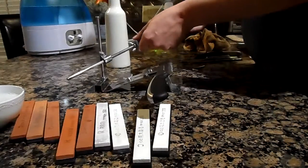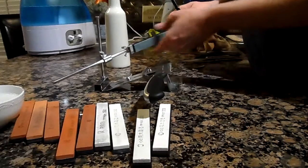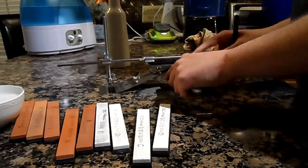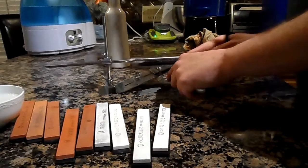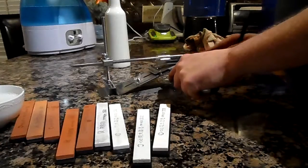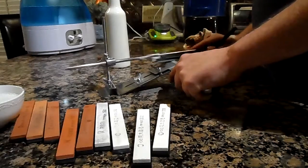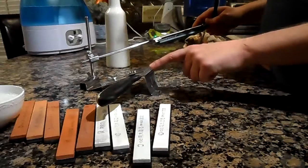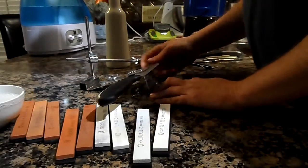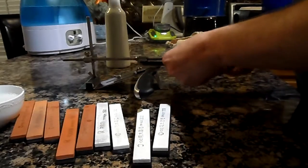The dogs are a cool thing — it's just that quick. After you get used to using this thing, it's almost an afterthought to get sharpening with it. This handle makes it real good. I think you have more control holding it like this, so I just do it like this. We will hear the raspiness begin to come off that blade as we slowly and evenly work it up. I'm paying attention to that frosty bevel — I want to see it. I want to be able to see it as it's happening. I can tell it is happening because it's way smoother to the touch.